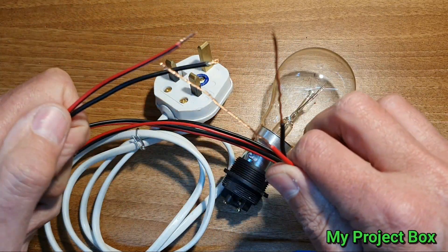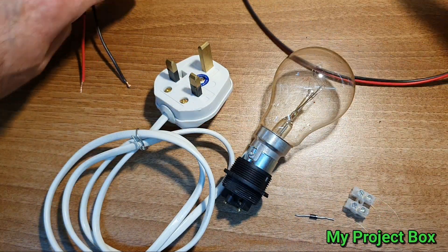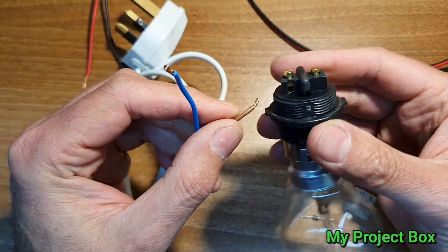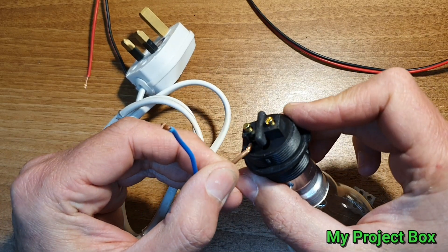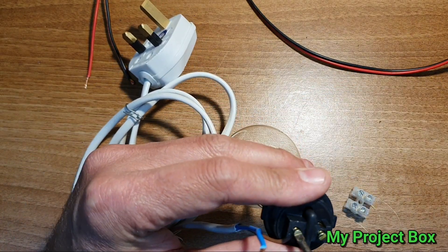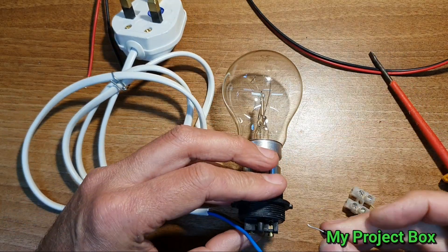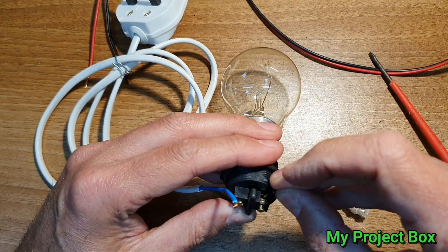This will go to the battery terminals on this side. All you really do is feed the live into your light bulb socket, like so, with the diode pointing away — stripe pointing away from the socket — with a little bit of wire.